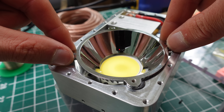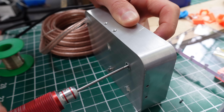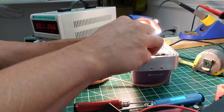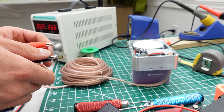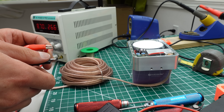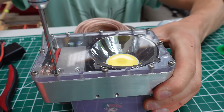After that, I installed this reflector, which also serves the purpose of securing the LED in place. The screws that hold it on go through the entire housing, so I was sure to silicone those before putting them in. I measured that the LED was drawing 8 amps if I touched the alligator clips directly onto its input connector, and 8.7 amps if the power goes through the wire. That means there's about 19 watts of losses in this wire, out of the 230 watts it's drawing in total. To seal the cover, I added silicone around the edge and screwed it on with a crap load of screws.